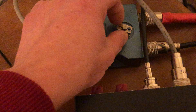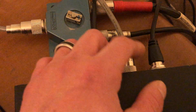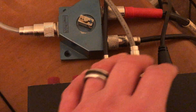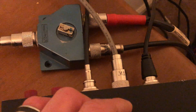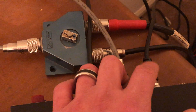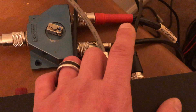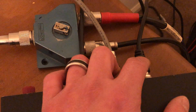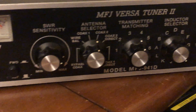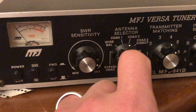This black RG-58 two-foot jumper goes to the Yaesu. I only had a two-position switch and had been using that with the gray one for the longest time. My buddy suggested I could just use the tuner and plug in another coax. So coax position one and coax position two — coax two is now hooked up to a Radio Oasis six-meter dipole, which gave me a third option.